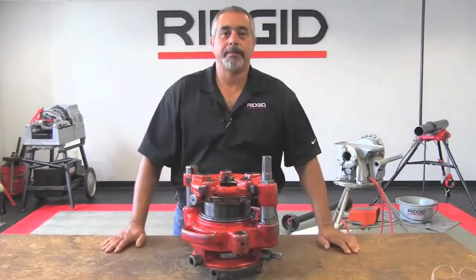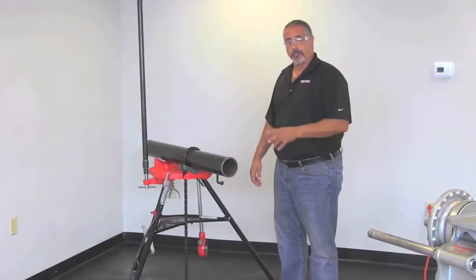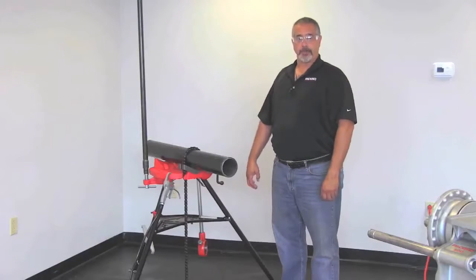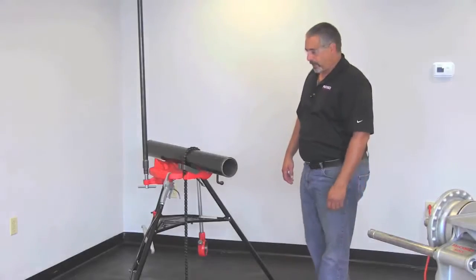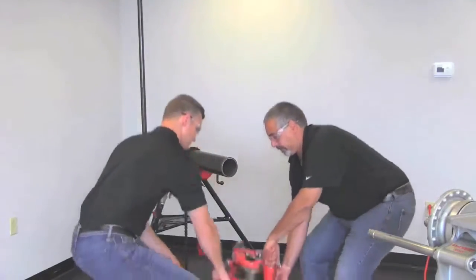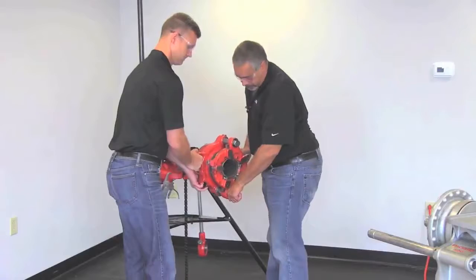So we'll flip this up here, and in the next video we're going to show you how to mount this to the pipe. In this portion of the video, we're going to show you how to mount the 141 to the pipe here, and we're going to do a stationary thread using the 848 drive bar. As per the manual, it's a two-man lift, so we're going to grab this by the handle and slide the chucking mechanism onto the pipe first.